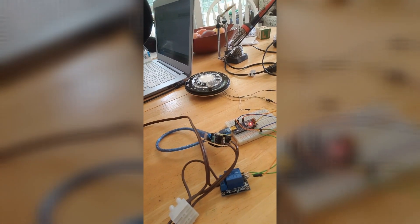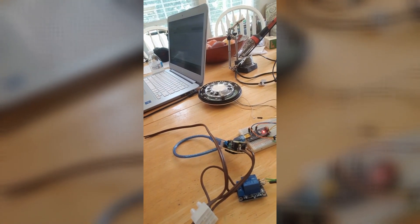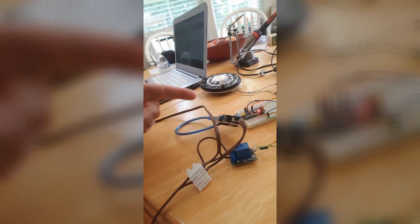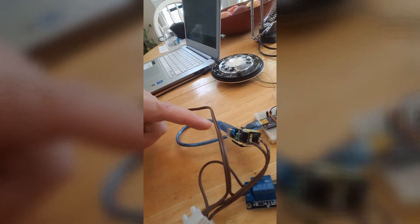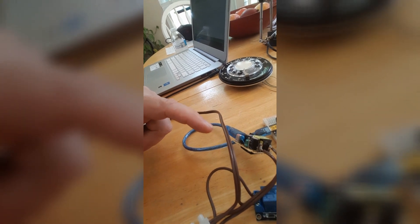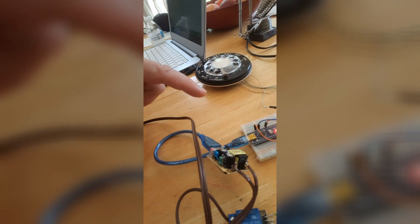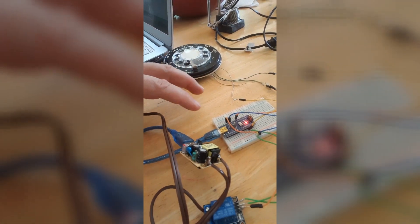I got everything kind of wired up just as a test, and I'm going to try it out for the first time. This little LED light will turn on — that'll be the function of the lamp. I'm using an Arduino Nano, and I'm not very good at Arduino, so this may or may not work. It's plugged into a 5-volt relay, which is going to control the signal from the Arduino to turn the light on. The Arduino needs to be powered, so instead of running two wires to it, I'm using a wall charger to step the 120 down to 5 volts to power the Arduino itself. And there's my rotary dialer — when I dial the right number, a very specific number, this light should turn on, stay on, and function as a lamp.